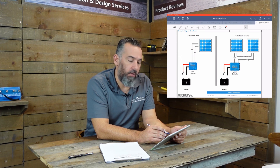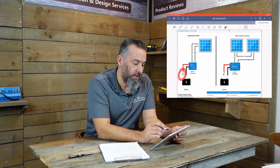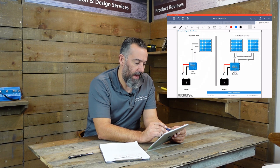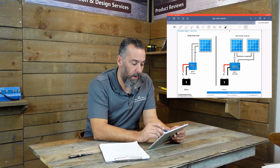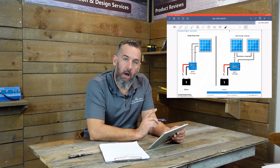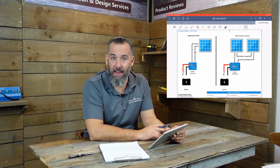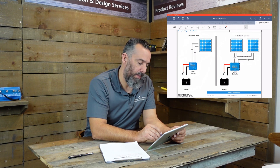You put that fuse right on the battery, and then you have it connected directly to the controller, but always at the start of the circuit. The start of the circuit, because it's endless power, is the battery.